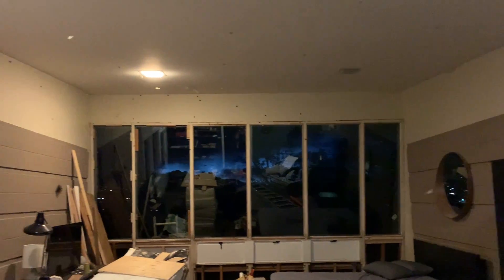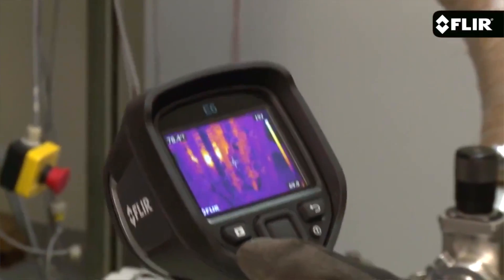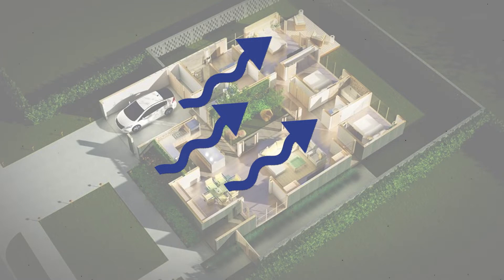Depending on the season — I did this in April — and depending on how well you close up the envelope of your building during the project, you might get unsolicited visits from fellow earth inhabitants. For single pane, it pretty much is obvious that it needs replacing. If you have single pane, chances are there are other parts of your building envelope that could help reduce heating and cooling costs. You can always rent a thermal camera from a home improvement store. For old houses, it's highly recommendable to avoid any draft and insulate the attic if it isn't already. In areas with high humidity, make sure there is sufficient air movement if you make insulation improvements. Here in Colorado it's very dry, so you don't really have to worry about that.